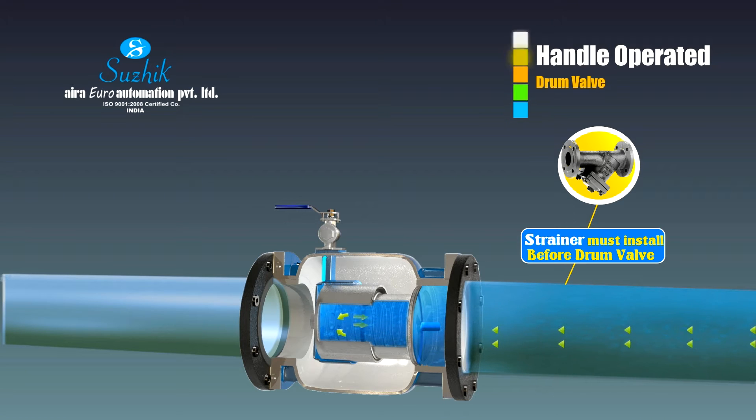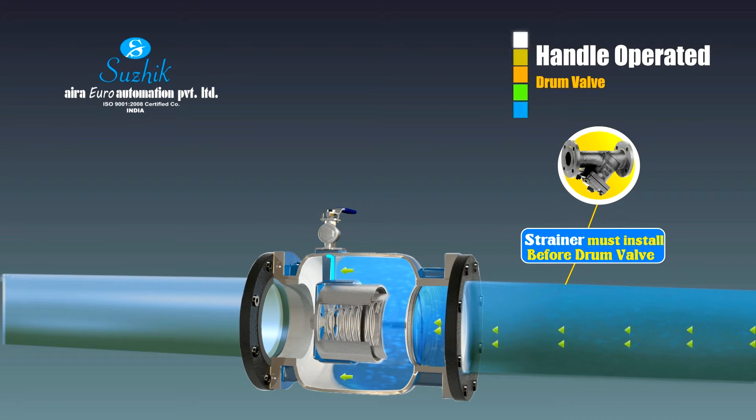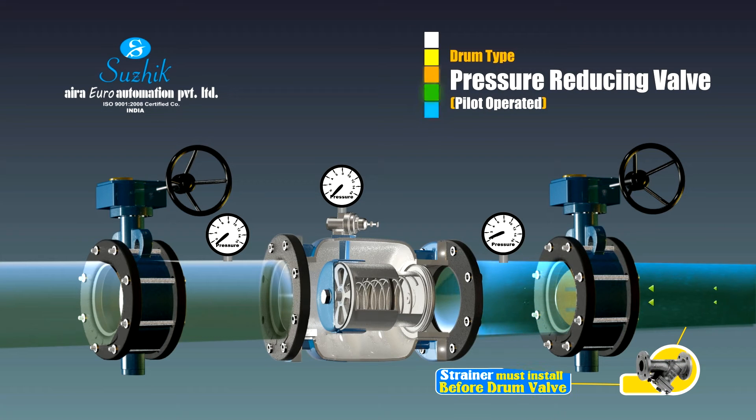This results in closing the valve from the inlet side to prevent water flow. When the ball valve is open, the pressure of the water is released inside the spring-containing chamber, which results in reduction in the chamber pressure, leading to the movement of the inlet plate away from the inlet, which provides water a way to travel from inlet to outlet.